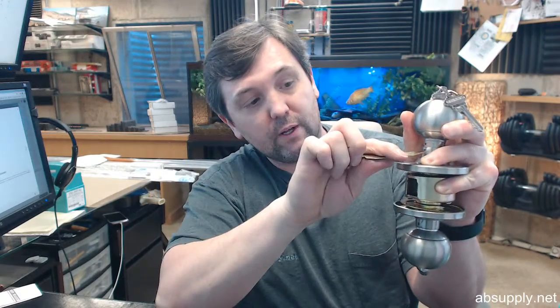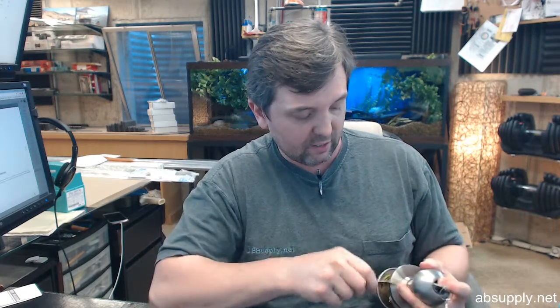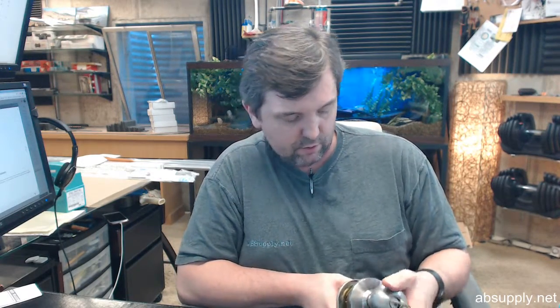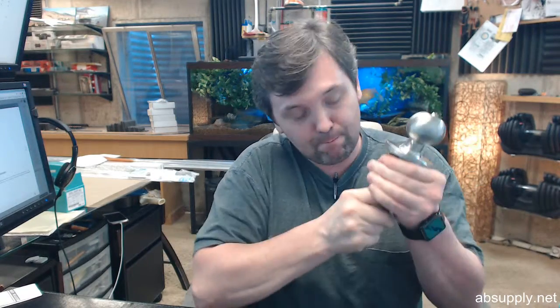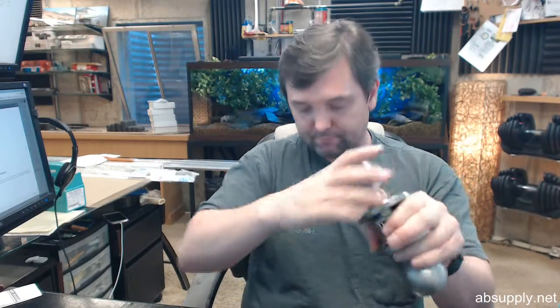Rotate that key 90 degrees. Hold it rotated, bring your spanner wrench to that tab, push it down, and then you'll be able to push that down and it will be locked in. And the only thing you want to do is visually inspect it, and that time it was a misfire. Visually inspect it to make sure that it is seated into the knob, because there's nothing worse, and take my word for it, than driving 10 miles away on a Friday afternoon from a lock job in traffic, and then the client calls and says the knob just came off in my hand. Pull on it to make sure it's seated properly. You can see there that it's seated properly. Okay, that's how you reverse it or rekey it in terms of access to the cylinder.